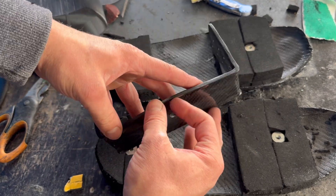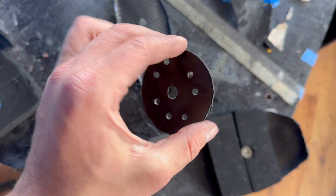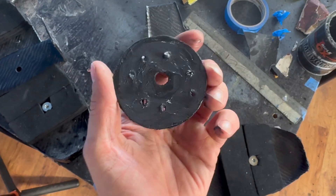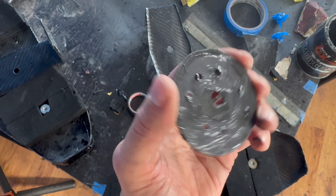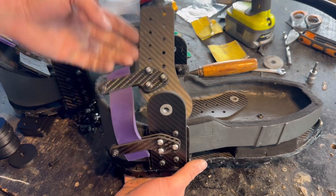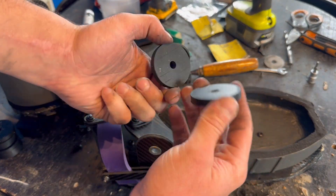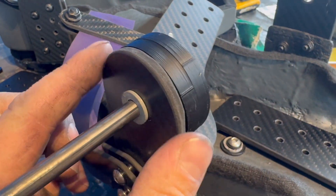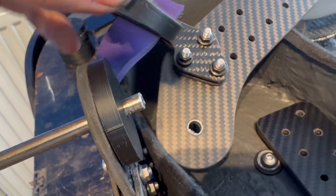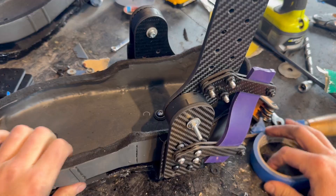It's time to fit that molded ankle bracket — it turned out pretty well, clear coating skills could be better but it's certainly strong enough and all the holes line up nicely. I also realized I need to make a washer for this to sit on so it doesn't wear through the carbon fiber — I've put some holes in it on purpose so grease can fit in to keep it lubed over time. With that mounted, I proceeded with fitting the carbon ankle hinge brackets and the elastic brackets for the achilles heel, complete with shoulder washers at the hinging point. I then fitted the spacers with some grease and got a steel tube shaft mounted through — steel because all the shock from walking will go directly through these ankle brackets.